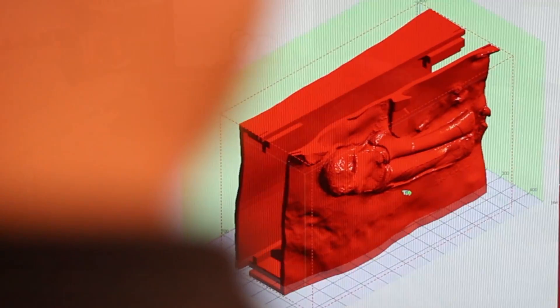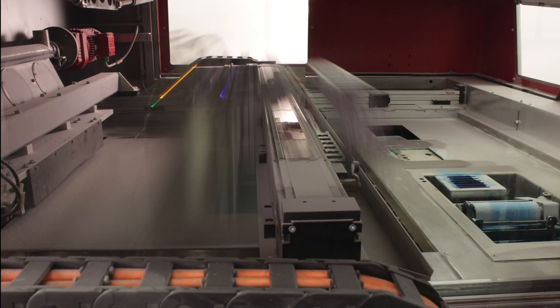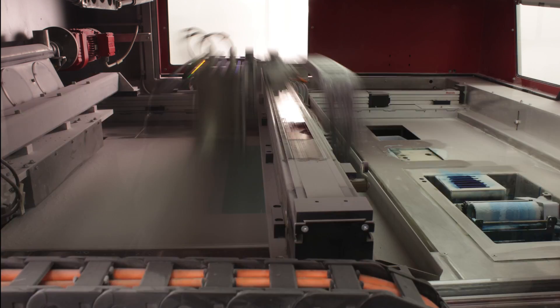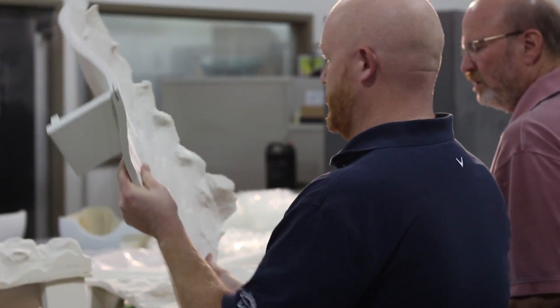Like any other 3D printer, we're building in thin layers, one layer at a time. This one is a little bit different in that it builds using a loose powder. We spread a thin layer of powder and then we selectively apply a binder to create the solid of the part. Once a layer is finished, we lower it by one layer of thickness, spread a new layer of powder, and repeat that layer by layer until the part is complete. We have to allow it to sit to cure for a few hours, and then we can vacuum away the loose powder and retrieve the tile we've built. One last step — we do apply a coat of epoxy to strengthen the part.